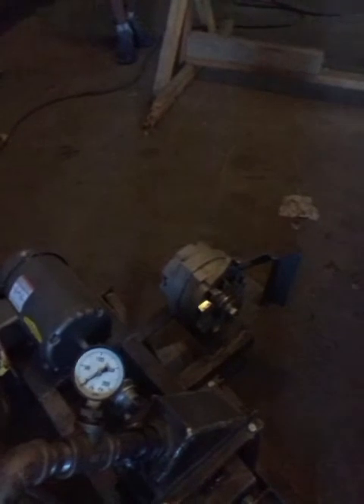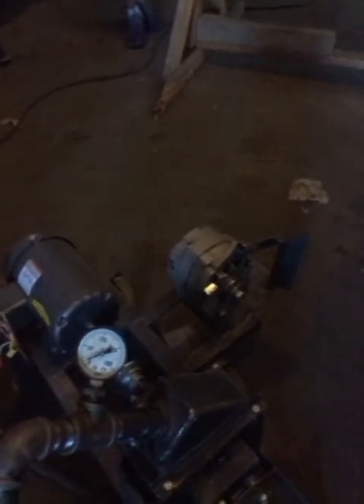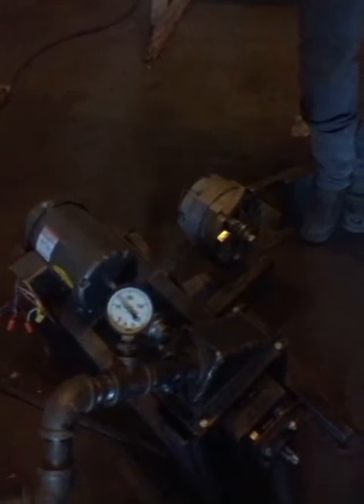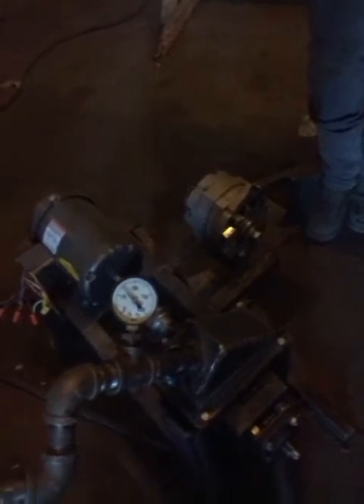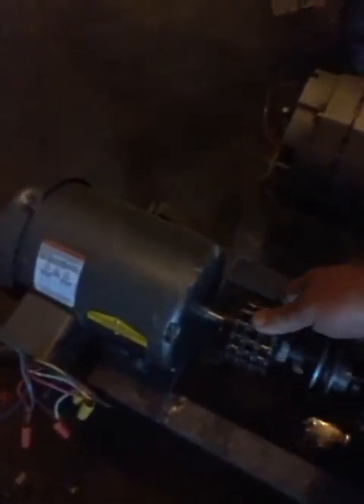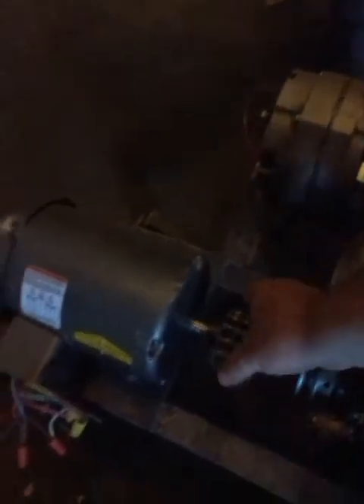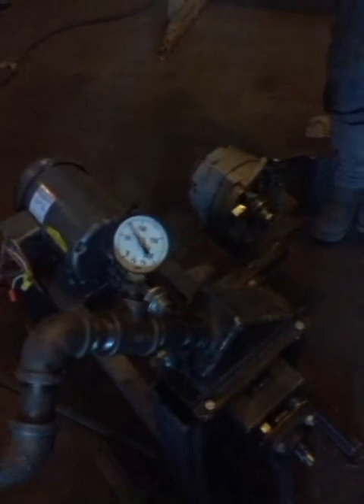Go ahead and start it up. We'll show you that this comes up very quickly because there is no tank with this — it's just right out of the compressor. And there we are. We're already over 80 PSI within a few seconds. And yet, you notice that it is not turning. It has the ability to free spin both ways, but it's not turning. There is absolutely no torque on this, and yet we're giving this 80 PSI.